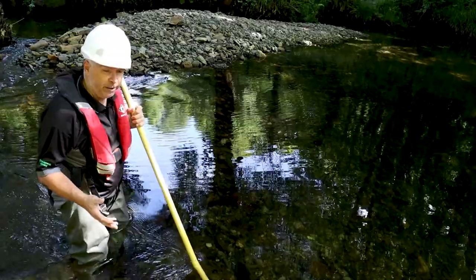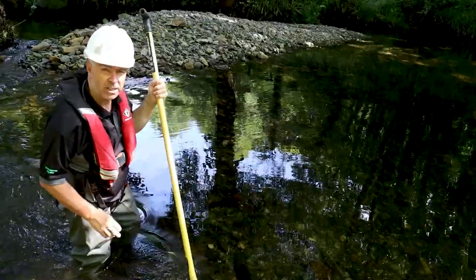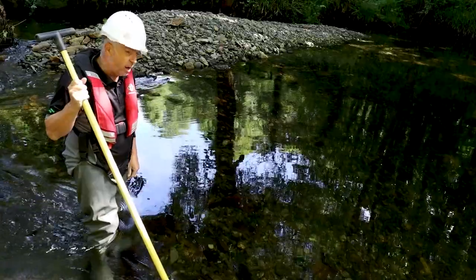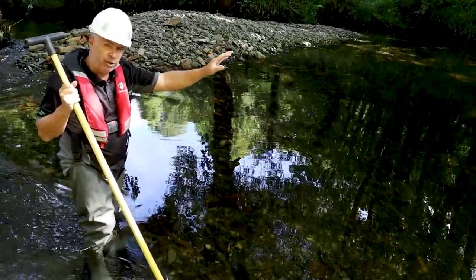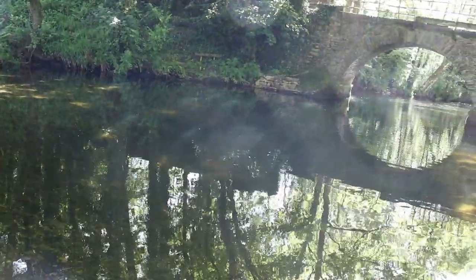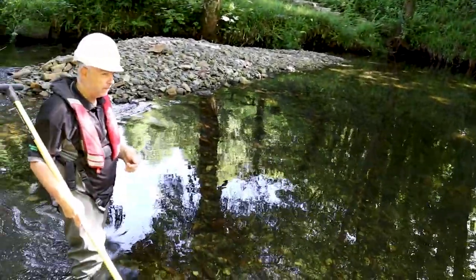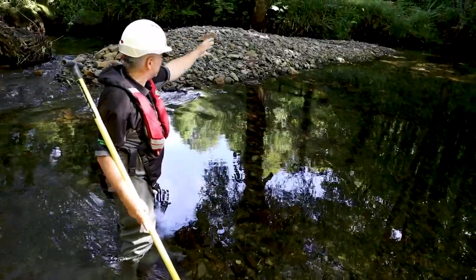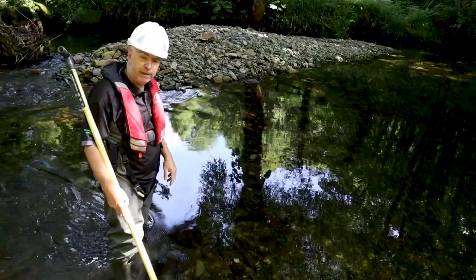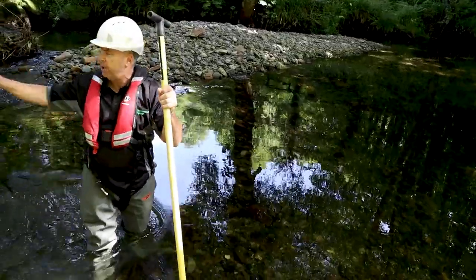Here we are now wading in the river — shingly bed in Devon, so the streams are nice and clear and you can usually see and assess the beds quite nicely, though not always the case. We're in about knee-deep water currently, wading with thigh waders on. Just upstream of me is the bridge we originally looked at, with a deep pool there. My access might be down those steps onto this shingle bank and then into this area to work, or we might be here to deal with that debris over there. We need to think about where's the best access, where we're working, and what it's like downstream.